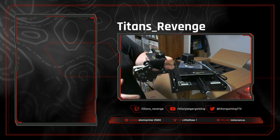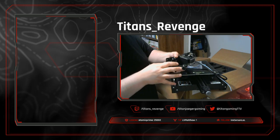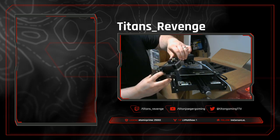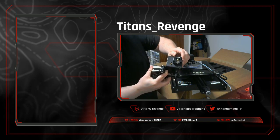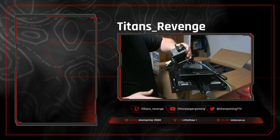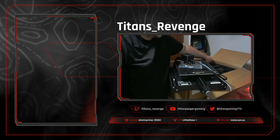Now, one of the things that I have done to replace already is I will remove this entire hot end. It's made of plastic and it's really good. So when you first get started out, this will be okay for you for a little while. You don't have to upgrade that right away. However, we've had one that broke on both the Voxelab and the Creality Ender, where the plastic broke due to the tension spring. So I do have the all metal upgrade, which keeps it nice and strong and allows for a lot better performance. Like I said, right off the bat, when this one gets put together, it's going to be put together basically upgraded. I don't want to have to play with it now and then come back and upgrade it later once a piece breaks down.